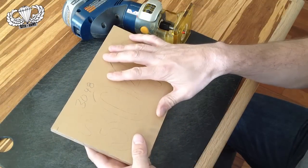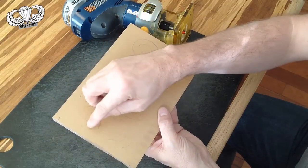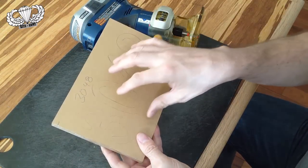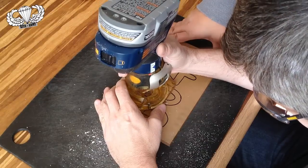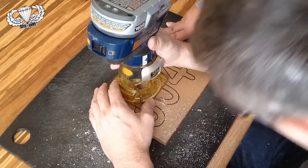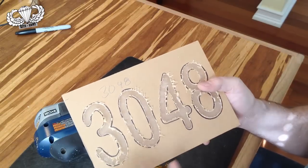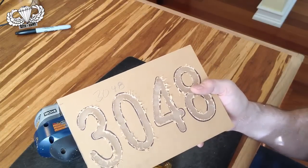I've got my piece of plexiglass here and I've stenciled on the house numbers right there. I also used numbers that don't have any sharp edges, because my router bit is round and that makes it a lot easier. So when you choose numbers to use on this, be mindful of that — try to choose a font that's kind of round with no sharp edges. I just finished routing out the numbers and they came out really great. My router bit matched the size of the numbers, so I just had to go over one pass and they look awesome.